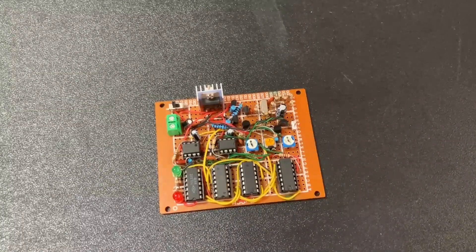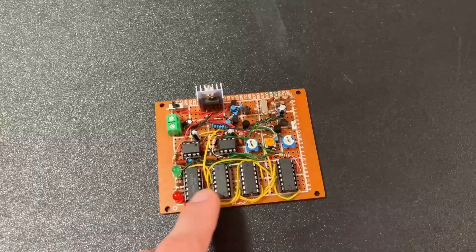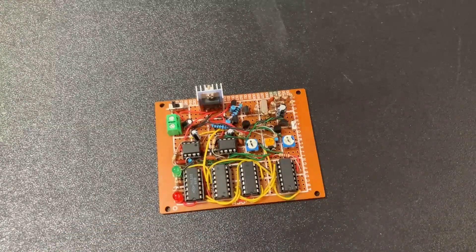Well, it's been a while, but it's been getting cold outside, so it's time to come in and work on some circuits, and this is my latest invention. This is a plain old AM transmitter, same design I've been using this whole time, but instead of feeding it an audio source from something like an iPod or a computer, I've created a Morse code generator and audio frequency generator using these integrated circuits, and those get piped into the transmitter. This is one self-contained board — all you do is feed it power and it plays a Morse code signal over and over again. Basically, I've created a beacon.